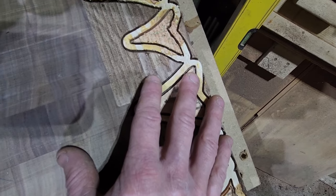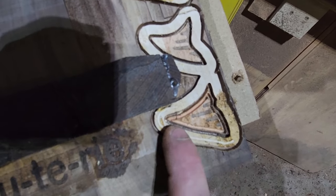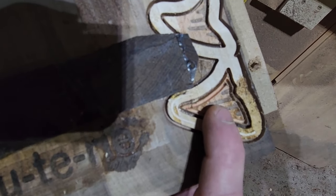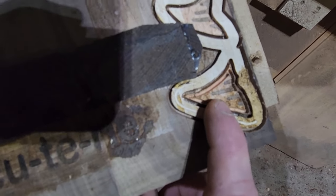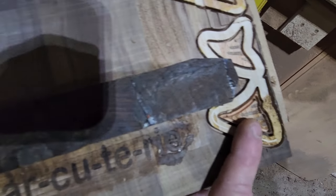If you notice here, I had a slight hiccup on my measurements. So I had to recarve out this tooth on both my pocket and my plug inverse. Now here is where it began to go downhill. I was manually moving my router back and forth to remove the positive end of these plugs. I was moving and grooving to the shop music and rocked out a little bit too hard. And instead of moving my X-axis over, I accidentally hit the button to move +5 down on the Z-axis.